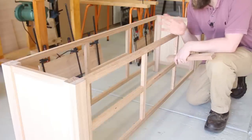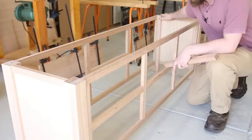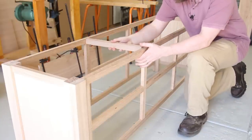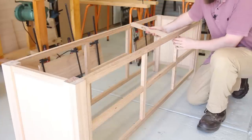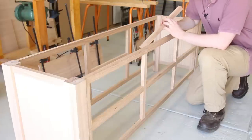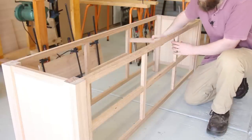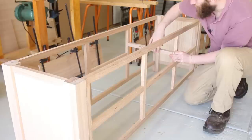We're getting there with the TV unit. The two frames are glued — they're not glued into the legs at the moment, just in there to hold it in place. The next thing I need to do is create spacers that will fit in between the two rails and give me somewhere to screw the drawer slides on. I've got a whole bunch of these — they're the same width as the rails, 32mm. The height isn't overly important, they just need to be chunky enough to screw the drawer slides into. All up I think I need eight of them, which will do drawers on both sides.